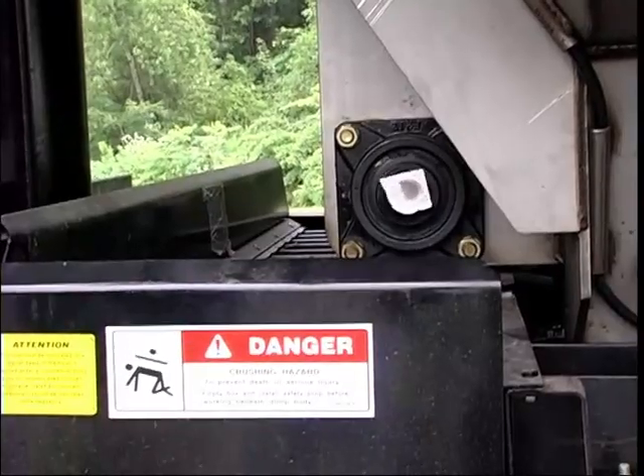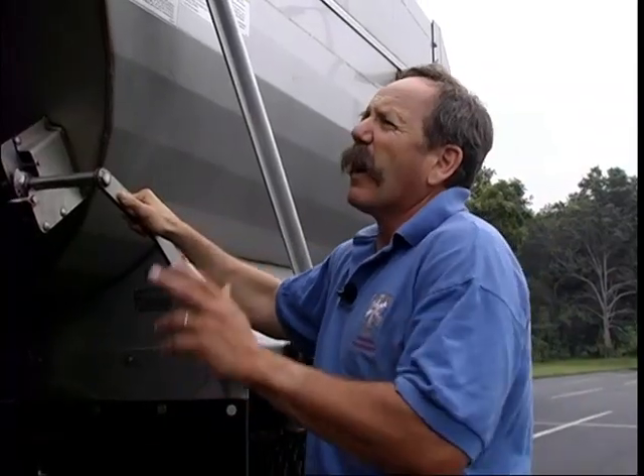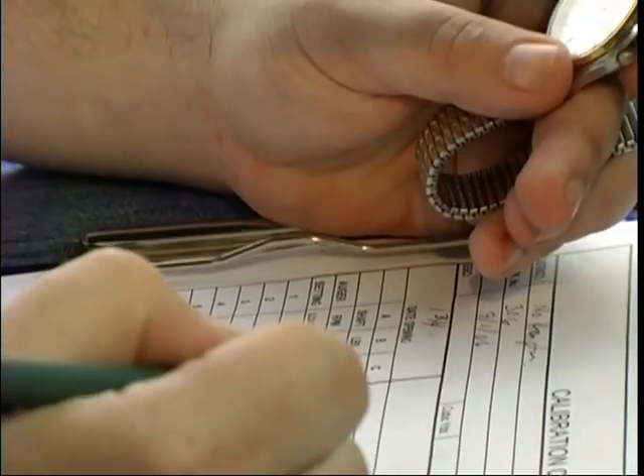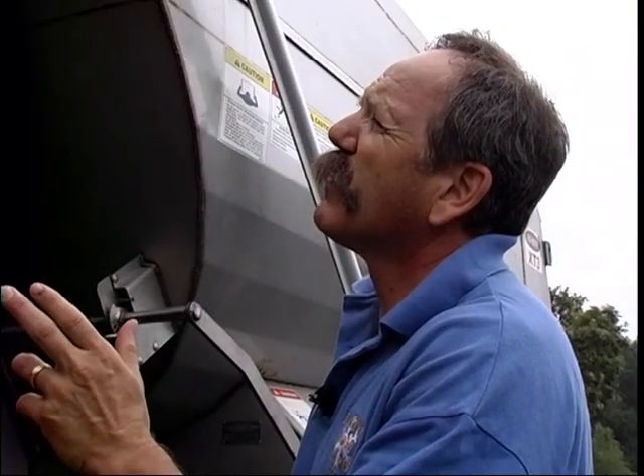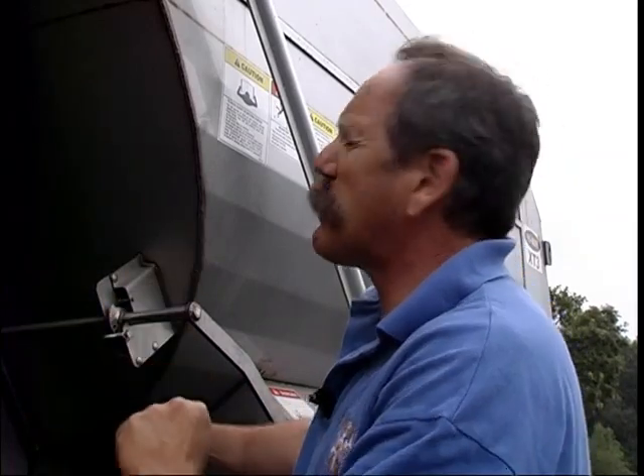What has happened is that the hydraulic system is maxed out, so therefore, even if we went all the way up to the top of the auger setting, it wouldn't change anything — we're all set as far as that's concerned. Now we get some material, measure it for one revolution, and we're fine.